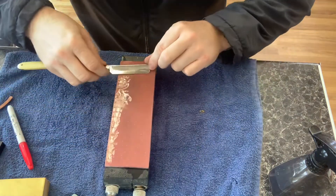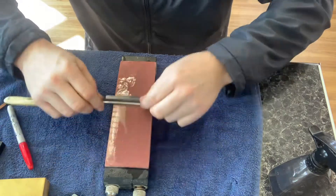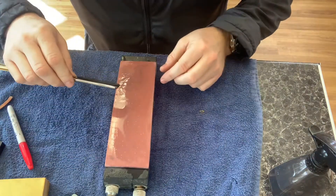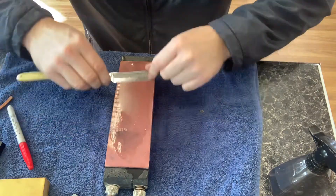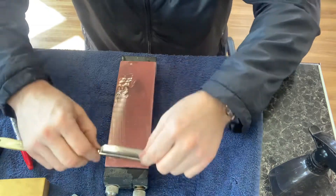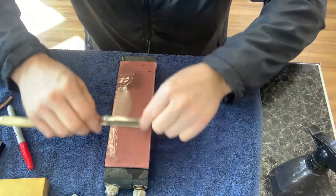Hopefully this video uploads. I'm just working on that curve that I've created, which basically acts like a wheel — it's really good. All we're looking for is new material at the back of the bevel, which it's already creating. I'm not using loads of pressure; it's a very fast stone, just letting the hone cut and gliding that razor over it, keeping the flat side flat.